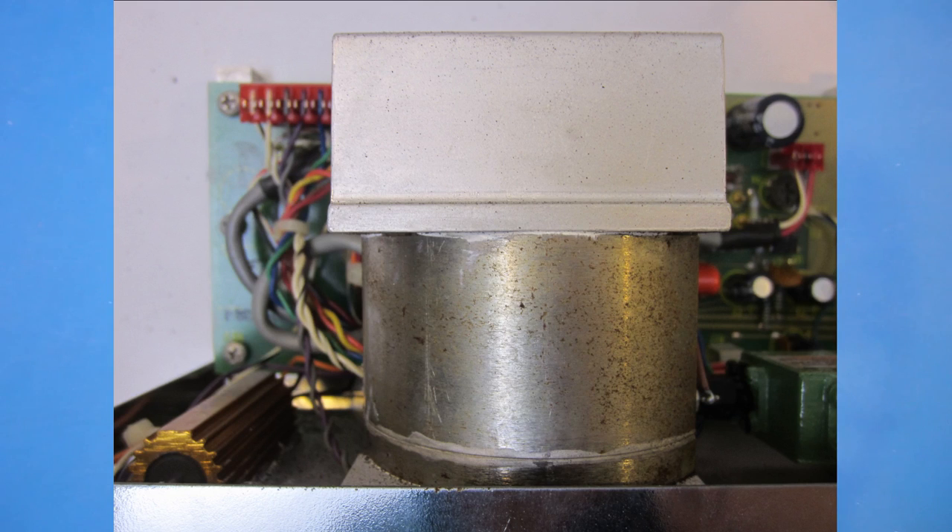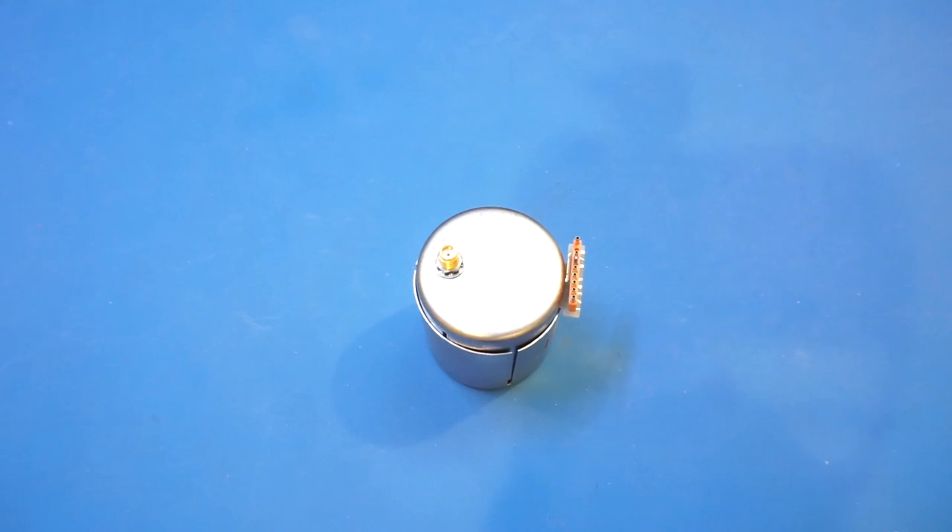I'll provide a link in the description below for those who want to take a detailed look. Here I'll show a couple of pictures from that teardown so you can understand what typical internal construction looks like. The core of the YIG oscillator is the YIG sphere, which serves as a tunable element. For temperature stability, the sphere is usually mounted on a thin rod with high thermal conductivity so that a heater can regulate the operating temperature. The rod cannot be ferromagnetic, so it is sometimes made of beryllium, which is a diamagnetic material. Oscillators used in frequency sweeping operation, like this specific YIG I have here, typically don't have integrated heaters as frequency stability is usually not critical.